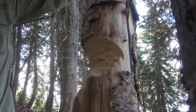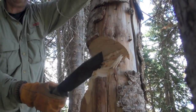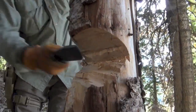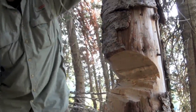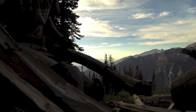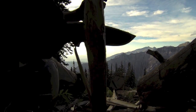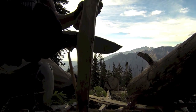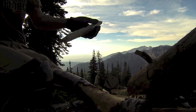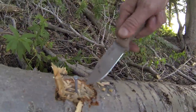These are made out of SR101 steel, jumping ahead to blade steel, by Busse. It is amazing. I have several years of experience with it, starting with that scrapyard military regulator. And it's what they say it is. It's a very, very tough steel. It's analogous, they say, to 52100 tool steel with added kryptonite. It has multi-stage tempering, cryo to 300 degrees below zero, which stabilizes the microstructure.